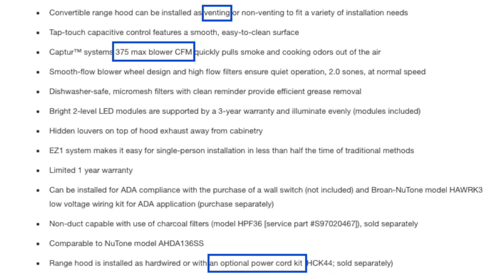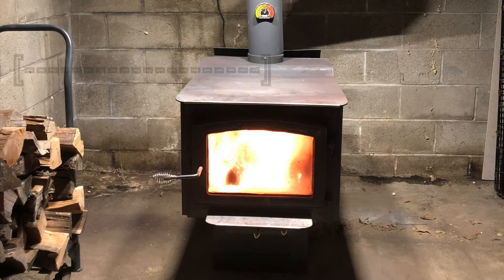As you're looking around on Marketplace, the top two squares here are going to be your two biggest factors. The first is you need to make sure that the unit you buy is able to vent and not just one that recirculates the air back into the room. And then the second is the CFM, which is a measure of the suction power of the range hood. This one is 375. I don't think you need to go any higher than that, but I probably wouldn't go down to the 100 or low 200 range either.